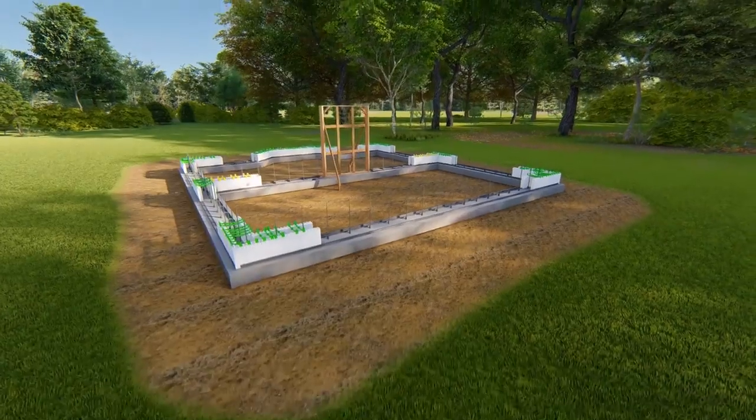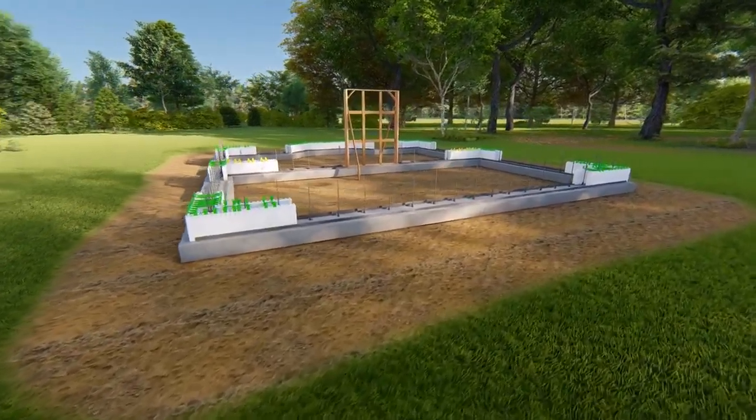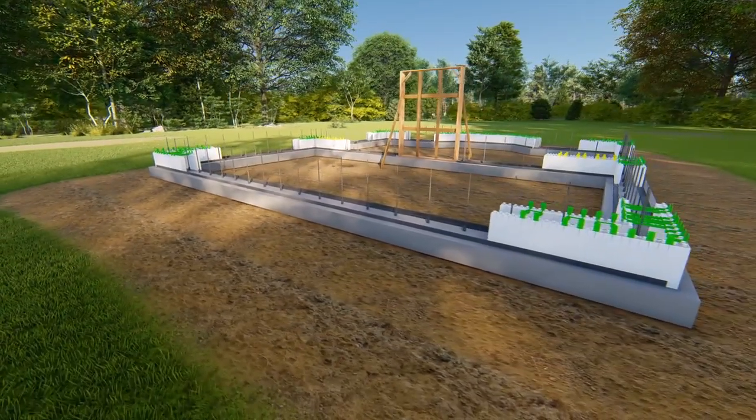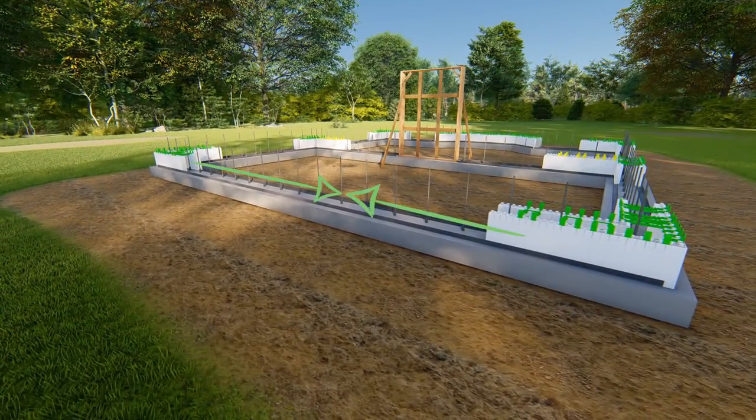While other forming methods may call for building into the corners, the design and precise layout of the Quadlock system is best suited for building from the corners to a common seam in the middle of the wall.